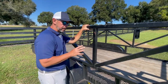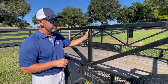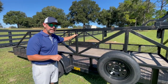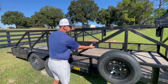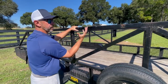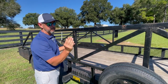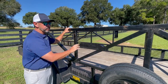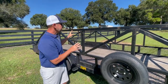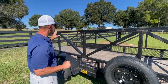The reason we went with two-inch tubing — it's a little more pricey, I get that — is that with thinner setups up top, if you go down dirt roads or anything like that, this oscillates with the dirt road. The upper half starts to shake a lot as the trailer's moving. If you have units against it, that pressure creates a lot of movement. The thinner metal means thinner welds, and your welds will start to crack and break. If you go with thicker two-inch and weld it up properly, you're going to get a lot more stability. It'll make the trailer a little heavier, but I'm talking about guys who have the units and want a trailer that will handle what they're trying to do.